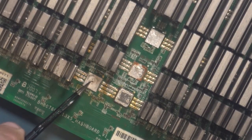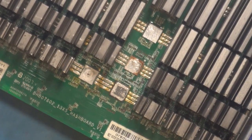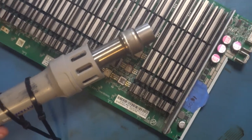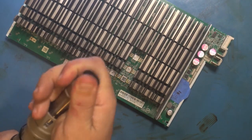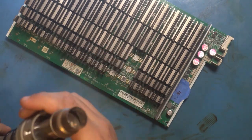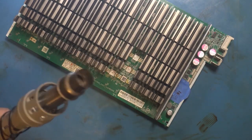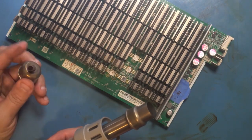That one I left a little bit of a solder spike sticking up on purpose, and so that's going to make us have to use another technique to put the heatsink on. Let's talk about the air station first. Personally I like to use the bigger nozzle — it's not much smaller than the wand itself, just a little bit smaller. But if you have a square one just a little bit smaller, that works too. Or if you want to use something really small, that also works, it might just take a little bit longer to get enough air on there.